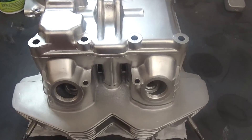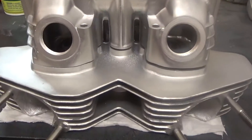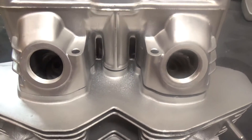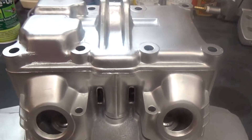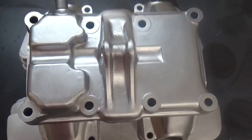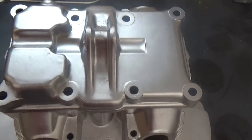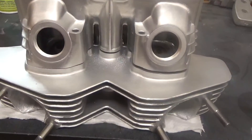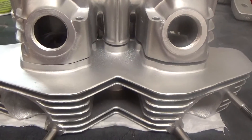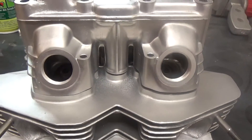If you're in the restoration markets, this is what your parts should look like. If the abrasive particles are still good inside the machine and they're not broken down, these are the finishes you're going to achieve. It's really hard to see with the light, but it's a very bright satin finish. This is with a medium to fine mixture glass bead abrasive and water mixed together — that's the finish you're going to get.